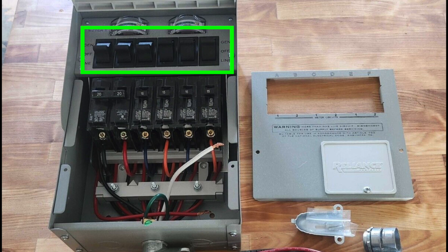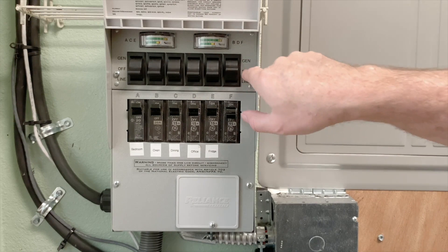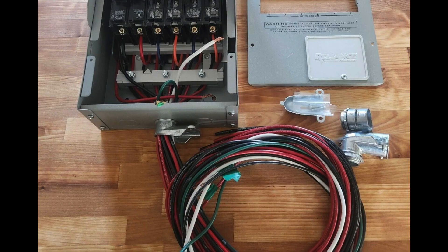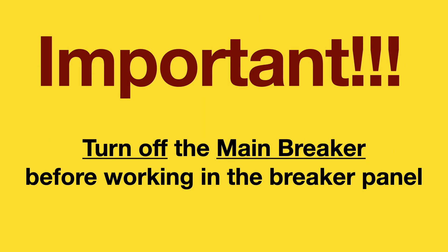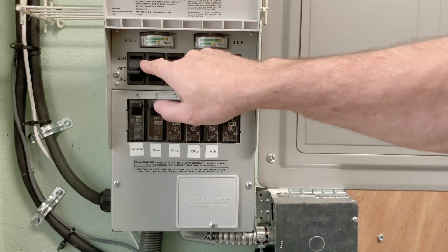The last thing we do is wire up the individual circuits attached to each one of these switches. Each switch has two wires coming from it: a black wire and a red wire. I have the smaller six-circuit version, so there are six switches marked A, B, C, D, E, and F. There are six red wires and six black wires, all marked A through F. Make sure you turn off your main breaker before you do any work in the breaker panel. The main breaker is usually a larger breaker at the top of the panel — mine is actually located outside in a separate box.